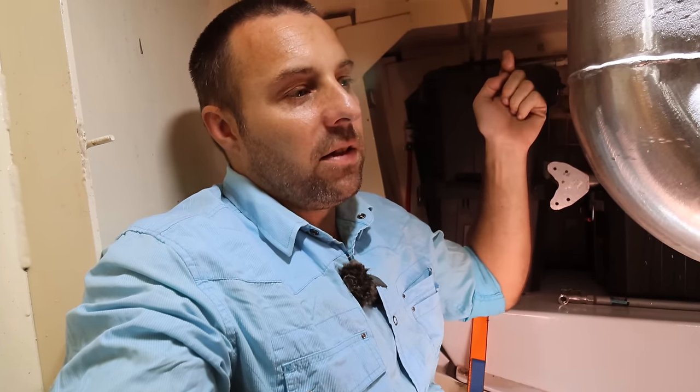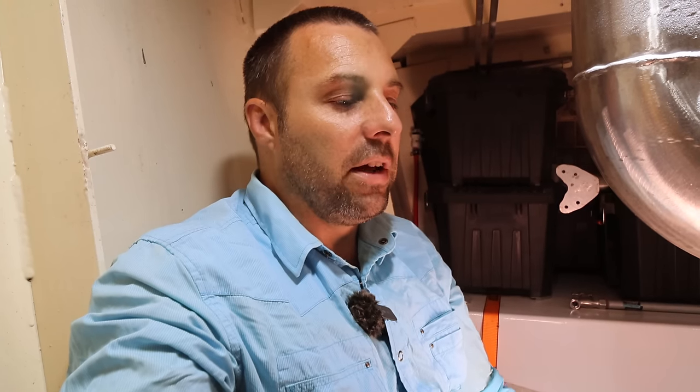From an engineering point of view, absolutely I can. It's a piece of cake to put all the other exhausts into this one. However, I don't know if that's a good or a bad thing for the other engines and so on. For example, if the genset, this little wee 5 kilowatt genset that we're working on here, is not running and we've got the main engine running, it's going to theoretically backfeed pressure and exhaust gas into the small generator, which is going to be a really bad thing for that generator long term.